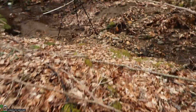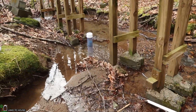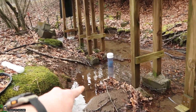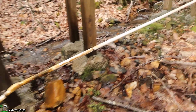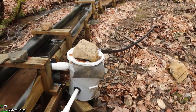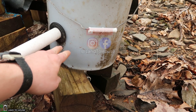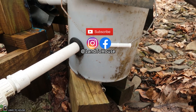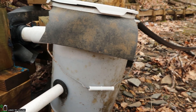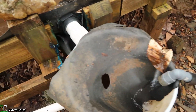Now let's walk up here to the bucket intake. The drive pipe pulls air-free water out to the pump. This bucket does two things: it allows an air-free intake and also catches a good bit of sediment and silt. You can see the drive pipe comes out here about four to six inches above the bottom — that catches silt. I have a feeling we've caught silt up to here, which is a lot. Feeding into this bucket is water from up the creek, but the flow is too low — we're gonna have to clean that out.